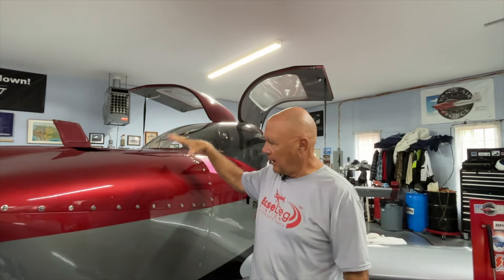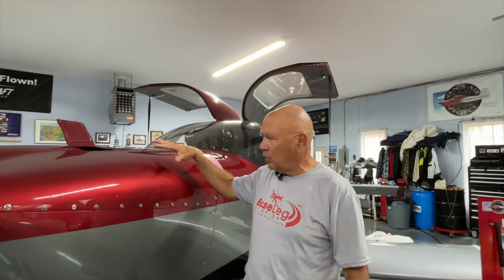We'll take some before and after pictures looking inside the cowling and attach them so you can see the difference. Now that all the RTV is on and the silicone baffling material is pushed down, it's important before the silicone sets to get the cowling on. Then get in there through the oil door with a borescope or mirror and flashlight and make certain all the baffling is wrapped correctly. Sometimes you'll have to push your arm in there and pull some of it back into place. Do that as quickly as possible, then let it sit overnight and cure.